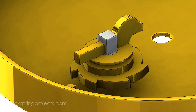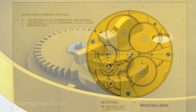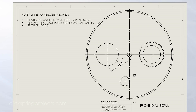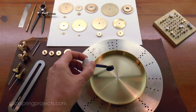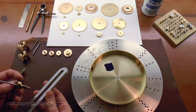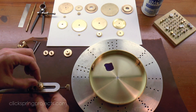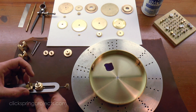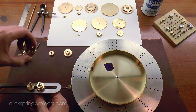The first assemblies to be located are the coaxial lunar zodiac and node display assemblies, which are positioned using one arc struck from the input datum point, and a second indicating the required distance from the centre of the mechanism. That first arc represents the optimum distance between the input assembly and the lunar zodiac assembly. And whilst I have provided all of the theoretical centre distances in the drawings, the actual figures are best determined using the depthing tool, to account for any small variations in the fabrication of the parts.